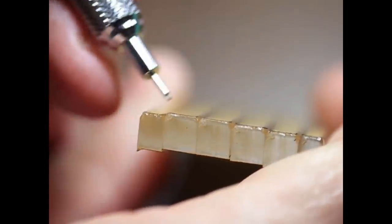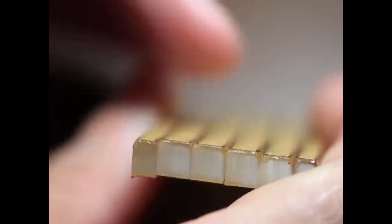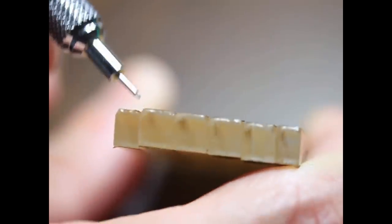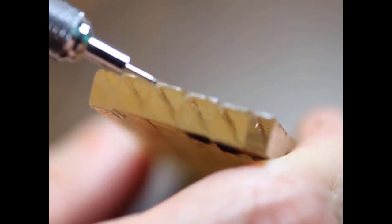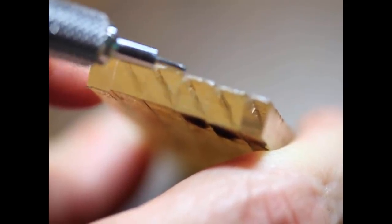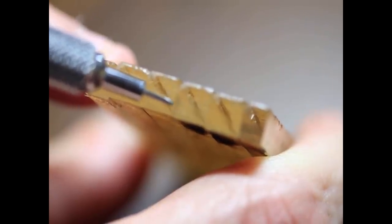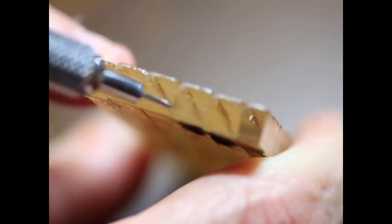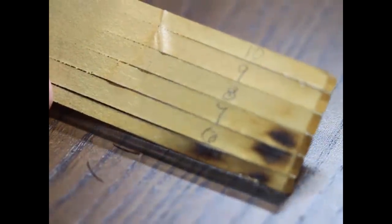This is also telling me I should be putting my nozzle pretty close to the surface when cutting. If I'm engraving, I want to put the nozzle farther away — but I'll do some tests with that before concluding. From my previous focusing work, if I put the nozzle at the convergence at the top, I get a much smaller point on the actual surface, which is good for creating photos and other engraving but not good for cutting. For cutting, you really want the convergence to happen more in the middle of the object rather than on the top. I hope this helps in your laser cutting endeavors — I'll be doing more tests to get a much deeper understanding of cutting and engraving. Thank you for watching.